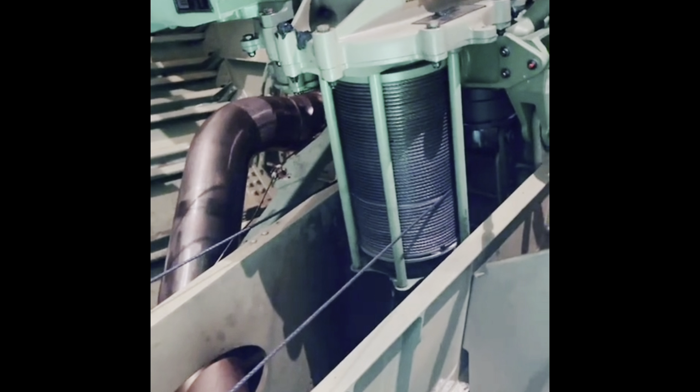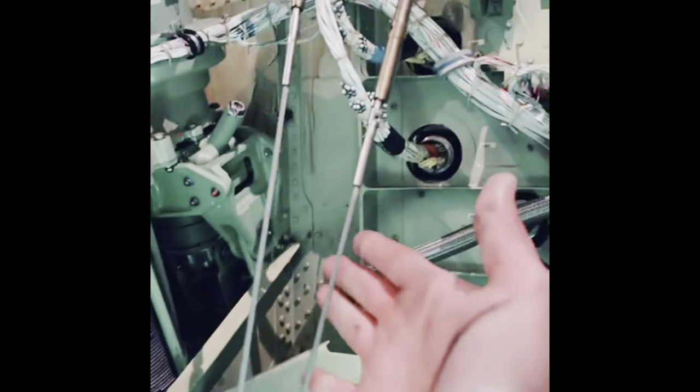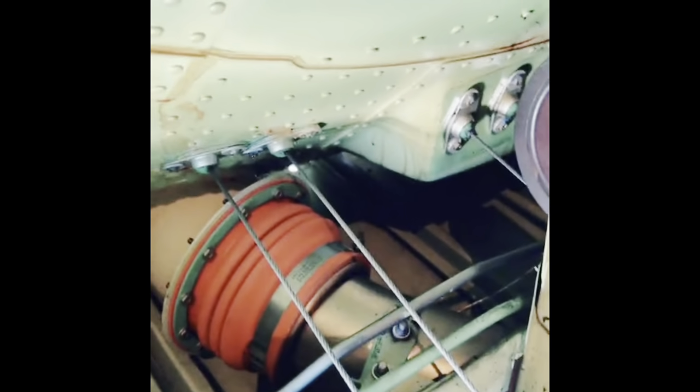The pilot and the autopilot can't control the horizontal stabilizer or the trim motor directly. The way this works is that the jack screw gearbox receives input from the stabilizer manual trim, the switches or the crank, the handle. When that happens, the trim wheel cables turn the aft cable drum that you're seeing right there. That's turning, their gearbox turns, making the jack screw go up and down. Remember, this aircraft is still a conventional direct control, so all you get is cables and pulleys. Most of the flight controls are cable driven, but hydraulically assisted.